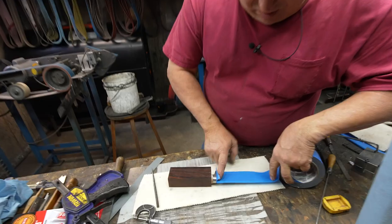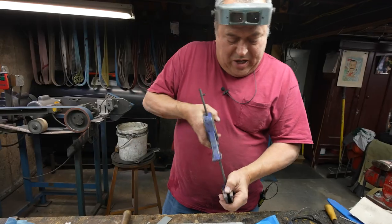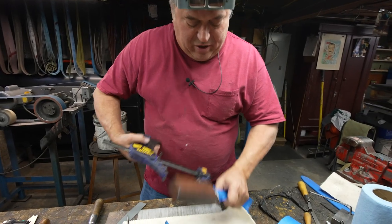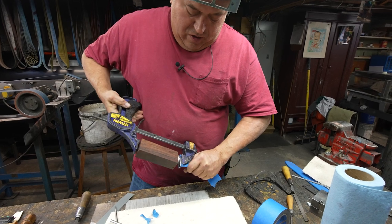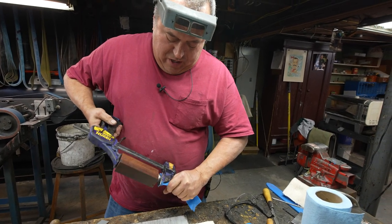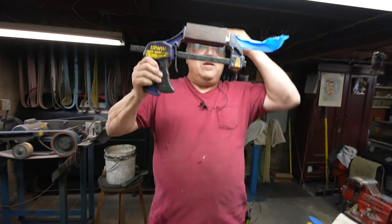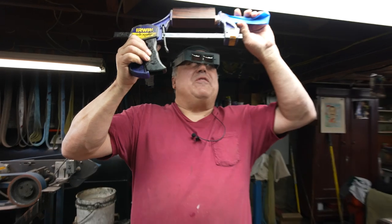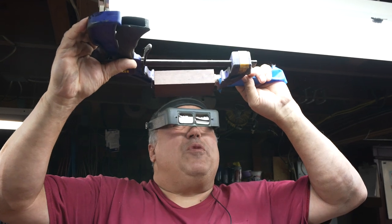So I'm going to protect my Damascus blade, which is nicely etched. By notching this and holding the back here, it enables me to go over the guard, grab the front of the guard, and then apply pressure to the back. Close it all up together. Close it shut. Then I'll hold it up to the light. Light's my good friend. And I see a little bit of gappage on the first ring. I'm going to hold it up 90 degrees, and it's pretty good there.